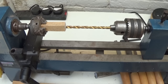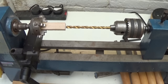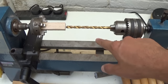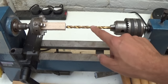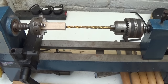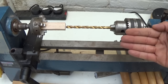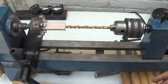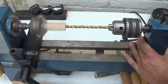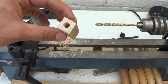I'm set up on the lathe with my blank held in my four-jaw chuck and a drill chuck with the drill bit. I'm going to drill through this blank all the way through — drilling in about a centimeter or two, then retracting the drill bit to let all the dust out, and carrying on until the job is done. That just took a minute and it's now drilled out.